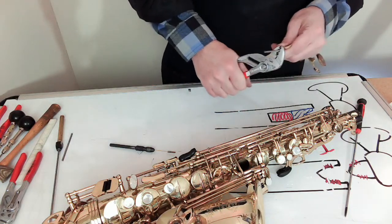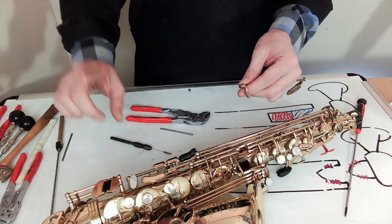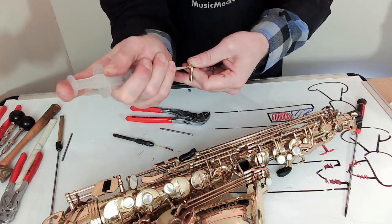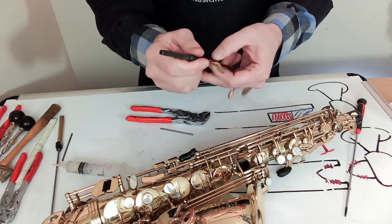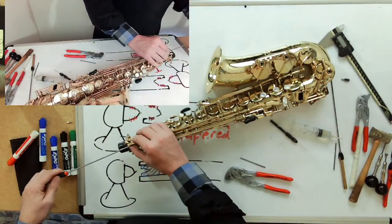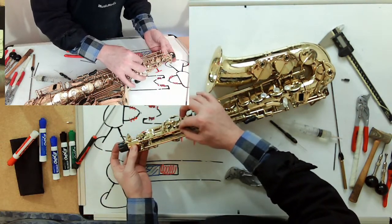So we're doing a little more swaging. You can never swage without your rod in the hinge tube. I swaged a little more, and before I put the bushing back in I'm going to show you how I lubricate it: I take this pivot and roller lubricant — handy that it comes in a syringe — and put a little bit right in the end of the hinge tube, then insert the spring-loaded bushing. Let's go ahead and reassemble.